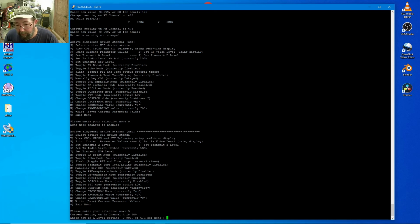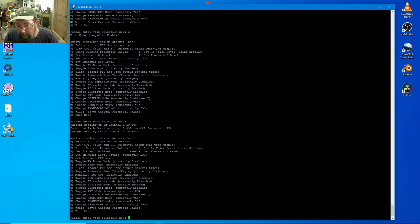So I'm going to knock this down with option number 3. Sorry, I should have said that. Option number 3 is your transmit level, the level going from your TYT back to your handheld. Option number 2, your receive level, goes from your handheld through the TYT and out to the internet, so you don't want that too hot or too soft. For a simplex node, you're the only one really hearing the transmit level, so set it to what you want. For me, it was a little bit hot, so I'm going to drop it down to 450 and hit enter, and then we'll do it again.